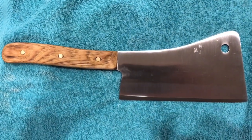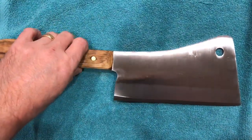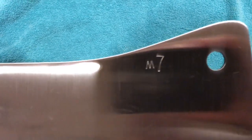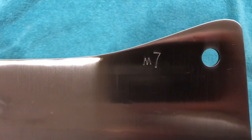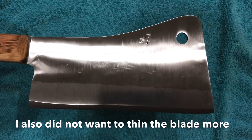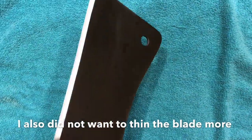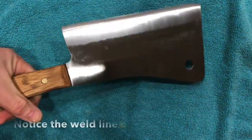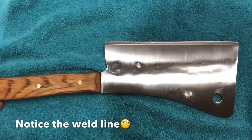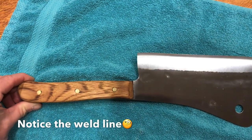So you can see the Scotch-Brite belt did a pretty good job. It's an ultra fine, got from Combat Abrasives. And really, I'm not trying to grind out those little low areas. I was just trying to mask them somewhat by blending them just a little bit. And you know, it actually looks worse here in the video just because of the lighting and the way the light catches those little low areas. Small little abrasion on this side as well, but actually looks very, very good in daylight.